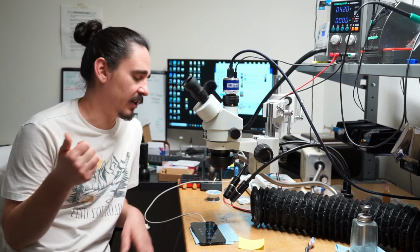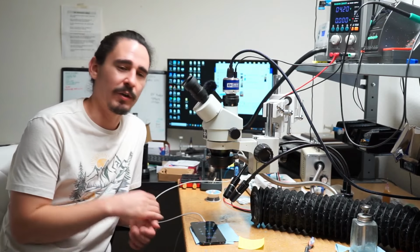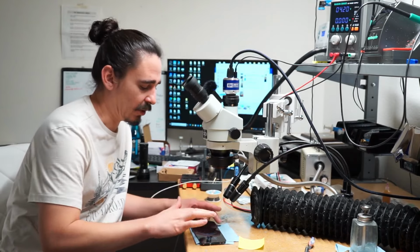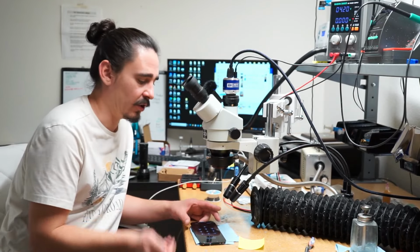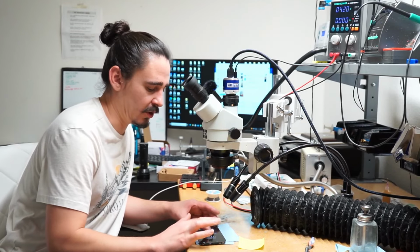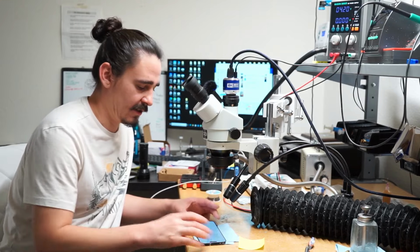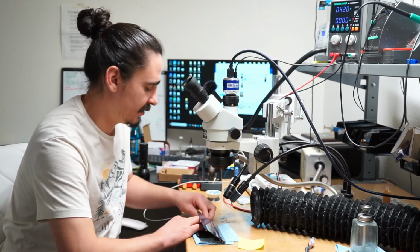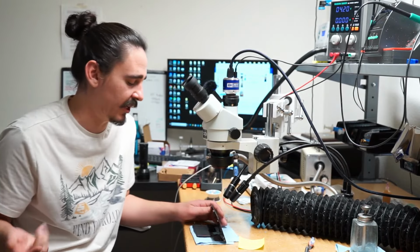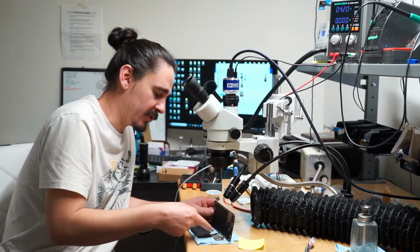And I actually watched Edgar from iRepair or Yo Reparo real quick, because I know he makes videos like this about the power sequence of iPhones. I watched one of his videos and made sure, and he said the crystal oscillator is required before the PMIC will turn on. And that's great. This is turning on. Big shout out to him. He's really good. I'm not sure if I would have changed that if I didn't watch his video. So that's really awesome.